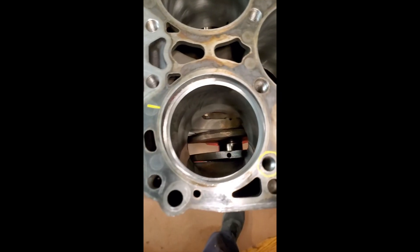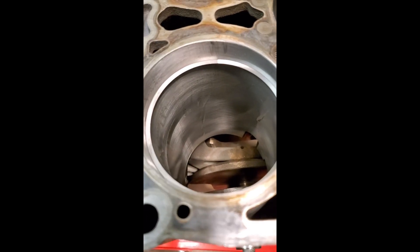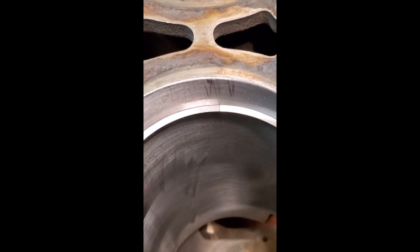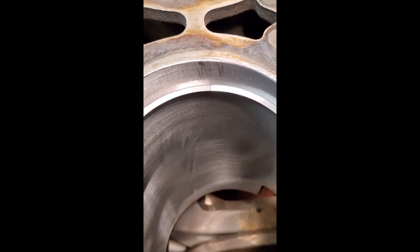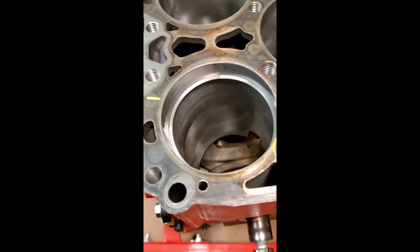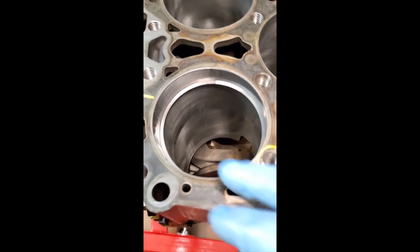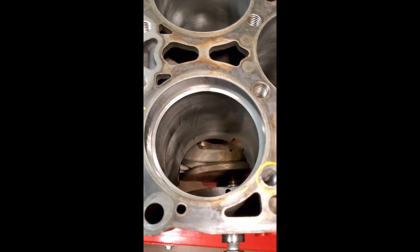Slowly getting it, grinding away. Finally have the piston ring down in the bore itself in the cylinder, and you can see where I'm grinding away. I have enough gap just to fit in there without touching, and then I'll slowly continue to grind until I achieve the desired piston ring gap. I have oil inside the cylinders as you can see — when you're sliding it back and forth it leaves little light marks, but that rubs away and I'll clean everything up.